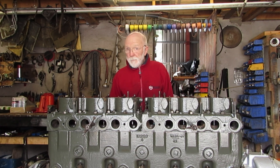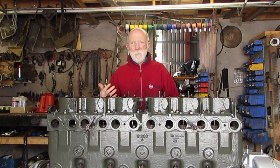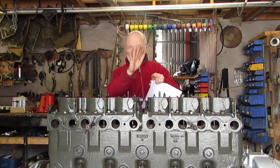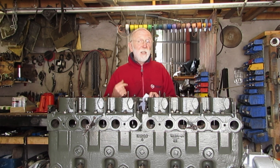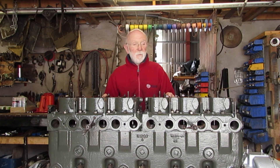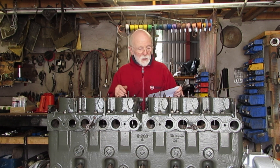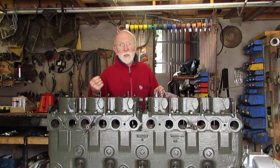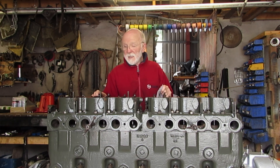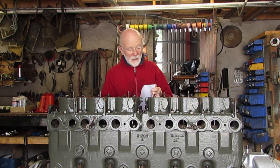We don't use chains. There are a number of reasons for that. Chains are inclined to slip — the coefficient of friction between steel and steel is quite low, so a chain will slip where a strap will grip. It's the same with wood. You'll find that hauliers, if you're shipping an engine on a pallet, only want it sitting on wood; they won't lift it steel against steel. They'll also want the engine drained of oil and labelled as such. We've had problems in the past where an engine leaked oil and the hauliers were not very happy about that.